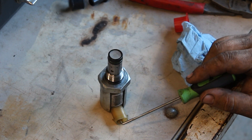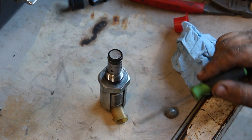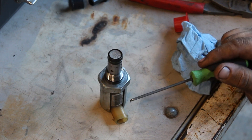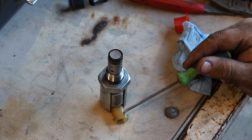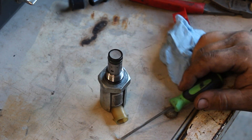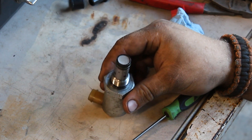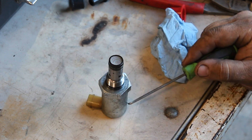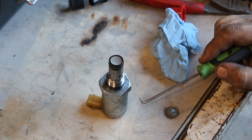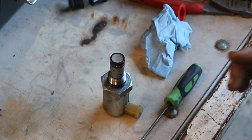Also check the condition of the plug itself. If the plug is broken, full of corrosion, oil, or contaminants, it may not be getting good clean power — or no power at all. While you're in there, make sure the plug is actually giving it power, which is critical. It will not cycle or actuate without electricity. Check for any obvious defects to the housing as well — it's unlikely but something may have fallen on it or cracked it. While it's out, give it a good once-over.